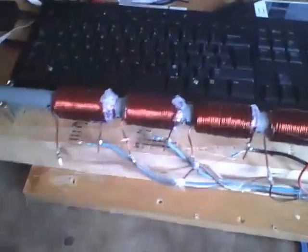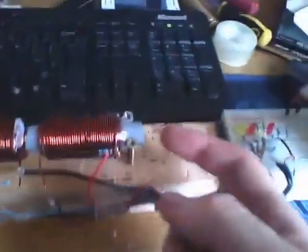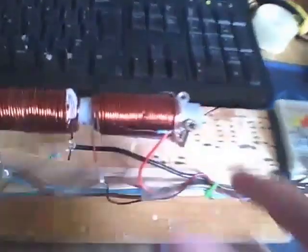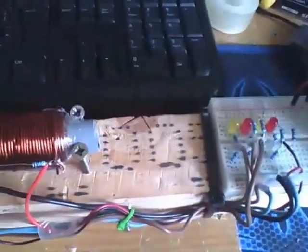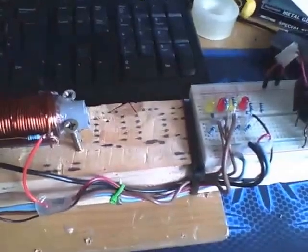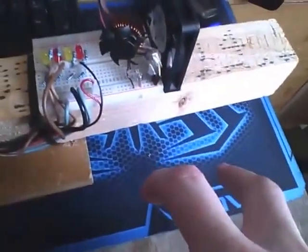So, how it works. Basically, you put the projectile here — it will be sitting here. Most people just leave the coils on; I can't because it will overheat and melt the tube. I'm not using carbon fiber, I'm using 15mm PVC piping for washing machines — couldn't get anything else. What I do is I'll have two switches: one for the 5V rail and one for the 12V rail. The 12V rail will go straight to the coils, and 5V straight to the triggering system.